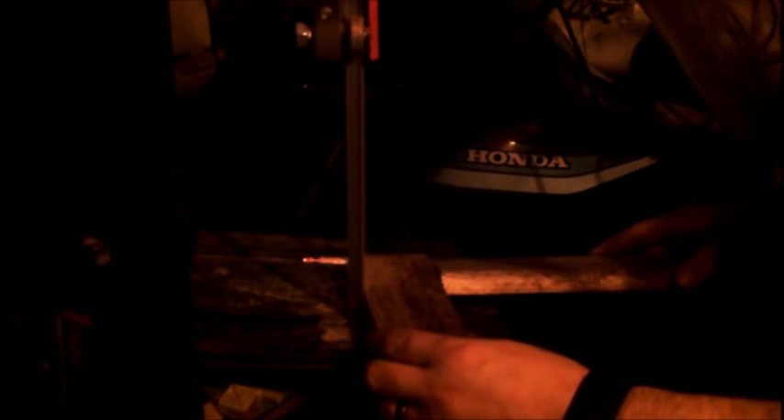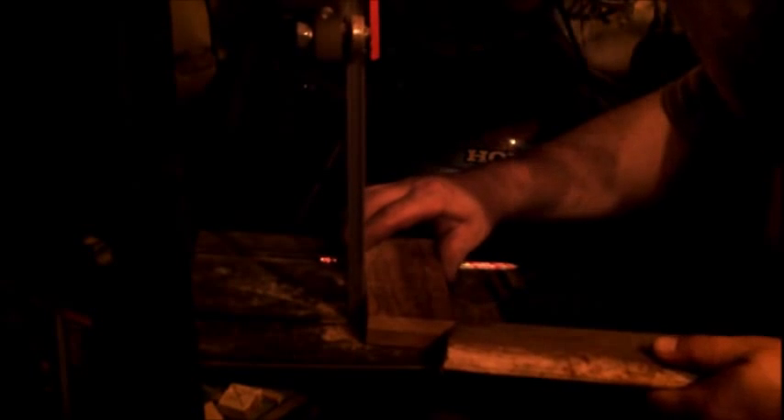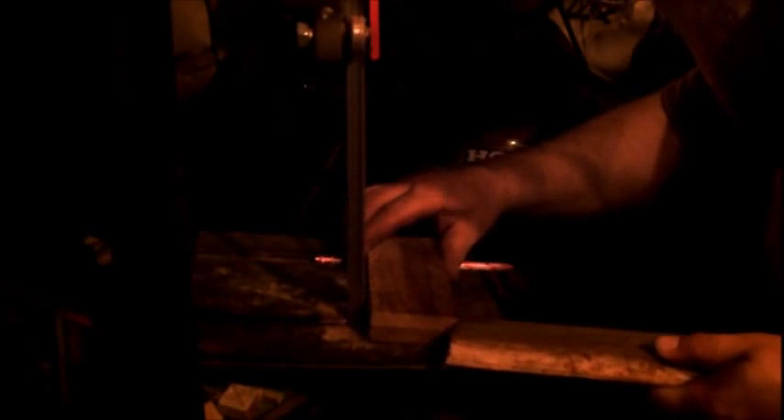Perhaps it's proper safe procedure — at work, on my big bandsaw, you can get the guard right down to here and lock it off so no one can fiddle. But this one doesn't seem to want to do that. Because normally the work would be fed in this way, but I've got them set up vertically, so it's in the wrong sort of setting. That's why the guard isn't orientated in a way that lets it come right down.